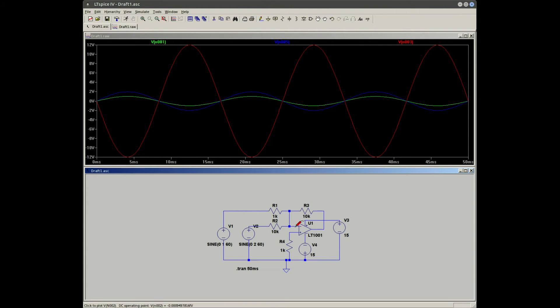The gain between R3 and R2 is still one, so we still get two volts peak to peak through that path. But with a gain of 10 on the R1 path, that gives us 10 volts, plus the 2 volts from V2, totaling 12 volts. The op-amp ensures the inverting input stays at virtual ground and pushes out an inverted 12 volts peak to peak. I hope that's been helpful and we'll see you next time.